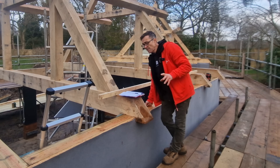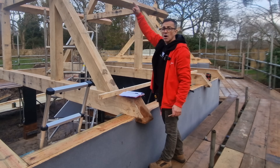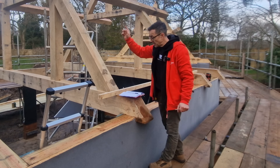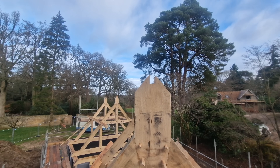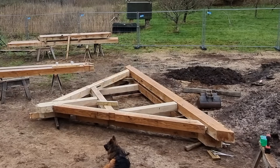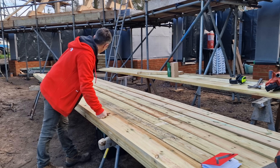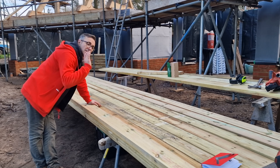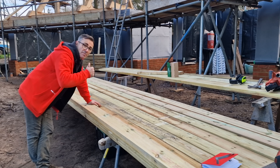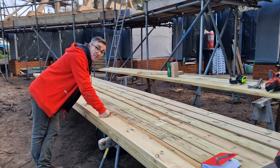I'm going to get down and make a pair of rafters, bring them up and clamp them to the side to mark exactly how the ridges sit on each of the trusses - because those two little notches on the top of the king post could be slightly to one side or the other. I'm going to cut a 50 degree cut on the ends, then using the pattern, mark out the bird's mouth and the foot, cut the foot off, cut the bird's mouth out, and put a bevel on the bottom of the feet because they're on show. I'll also pilot for the fixings, which is quite important.